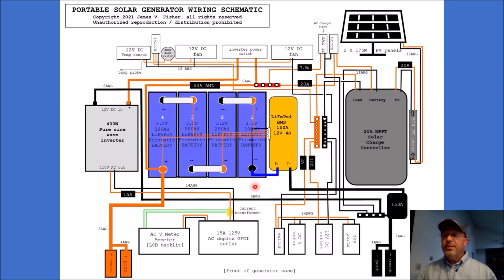You've seen the very large 2000 watt inverter that I intend to use — that's going to be external, it'll probably sit up on top of the case. The posts and terminals on the outside of the case are for those larger loads. The 2000 watt Renegade pure sine wave inverter will be connected to the positive and negative bulkhead terminals on the outside of the case, through two AWG wires for both terminals. The negative is attached directly to that 150 amp breaker, so that is the maximum I'd be drawing from the battery. The BMS I have maxes out at 150 amps, so the battery will never deliver more than 150 amps total — that's at the top end of what that 2000 watt inverter would draw.